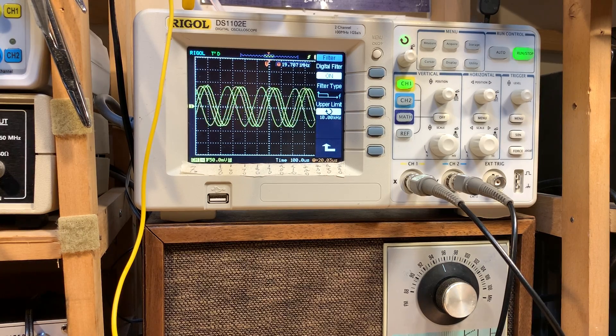So here we go. I'm going to tune down in frequency — there's zero beat. And then I go up — there's zero beat right there. I can get pretty close. There's like no audio coming out right there, and that's at 5.2398 MHz, which is right where I have the oscillator set. If I go up a little bit, and then go down to zero beat and to the other side, there it goes again. It's really pretty nice because you can see how the local oscillator frequency and the RF are combining to produce audio, which is exactly what we need this stage to do.